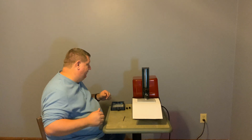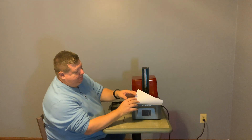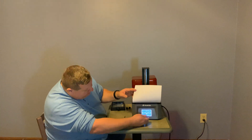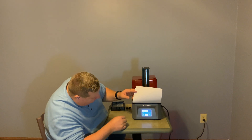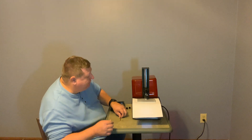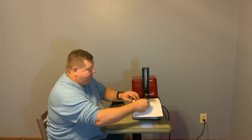I'm going to tighten the knob to hold the build plate onto the Z-axis lift and we'll turn it on. Now I'm going to go into Tools and Manual, hit the home button, and it's going to move around — up and down — until it feels like it's in the home position. Then we're going to tighten our allen wrench screws back down.